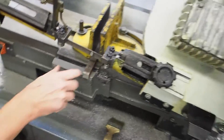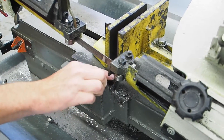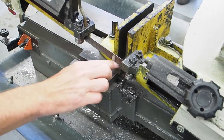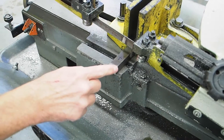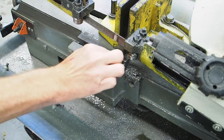After you've tightened it, we're going to do what's called the budge test. You grab your workpiece and you give it a shake to make sure it's tight. When you do that, you have to make sure you don't pull up, because if you pull up you can run your fingers into the saw blade here. Or on the end of the workpiece, sometimes there's a burr that's very sharp, so make sure you're careful of the end. I would grab it right here and give it a little budge.